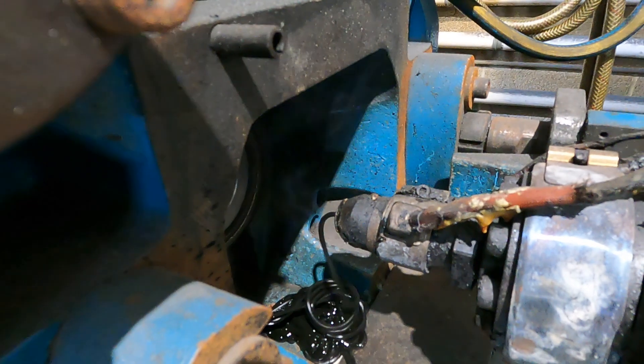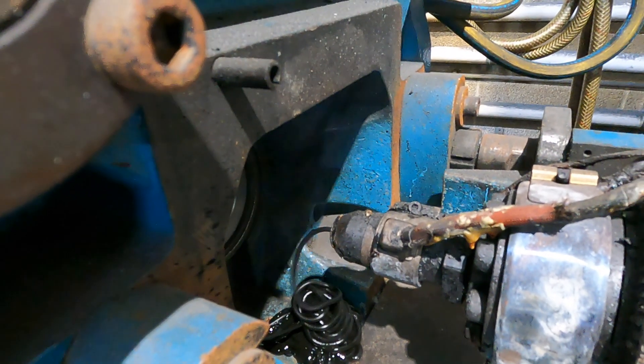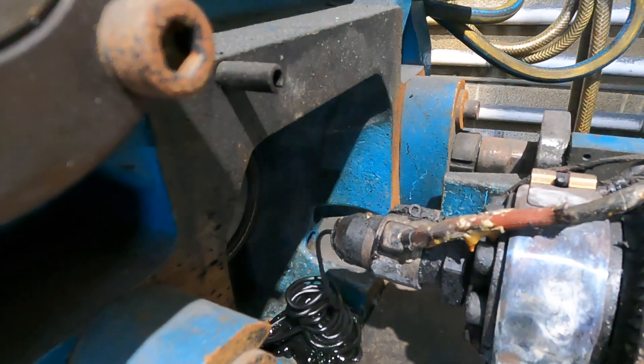We've got to clean out all of the polypropylene that was in it beforehand. Polypropylene and ABS are like natural enemies — you know, eggs and bowling balls, they just hate each other. They laminate to hell, they won't mix — they're really like oil and water. So we are getting all of that junk out.